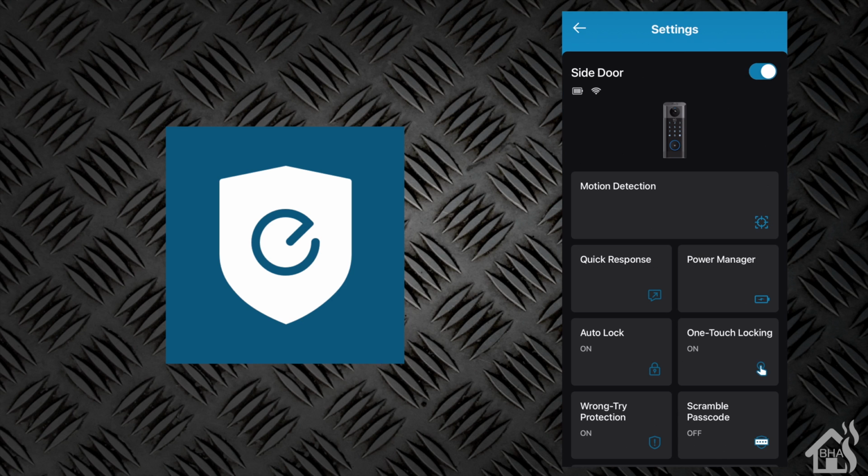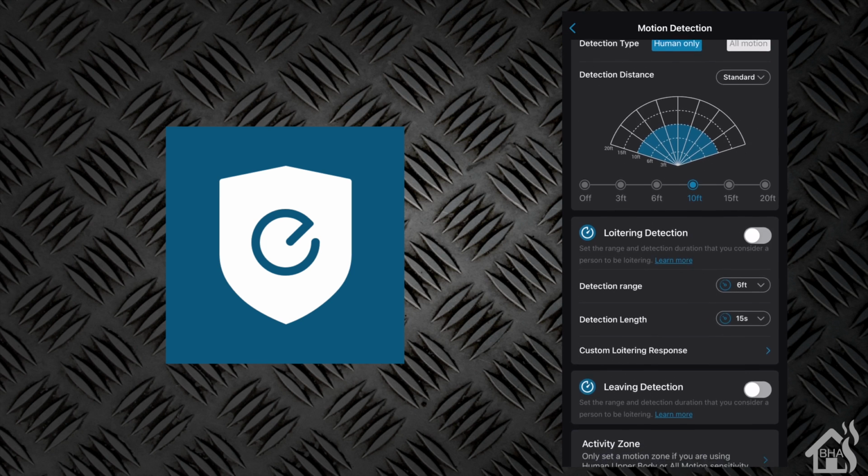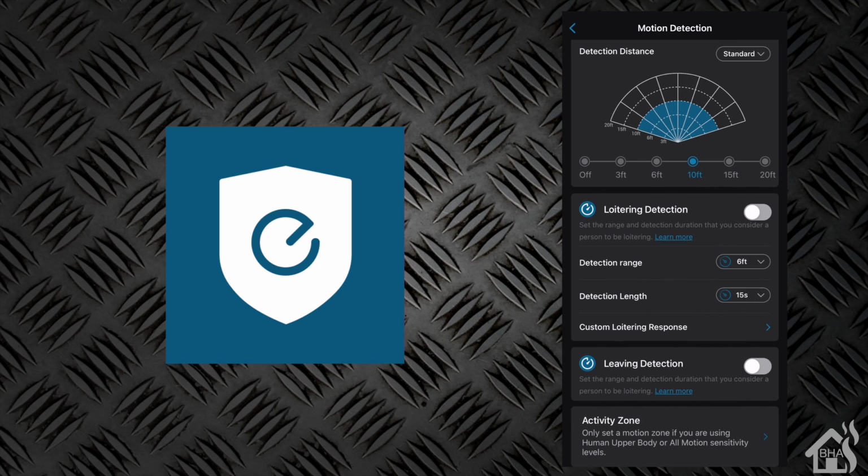We click on motion detection. This is where you can set the type of detection you want, if you want all motion or human only. And then you also have the ability to set loitering detection and leaving detection. So I'm going to enable loitering detection there. If somebody's standing outside the door, I'll at least get an alert for that.